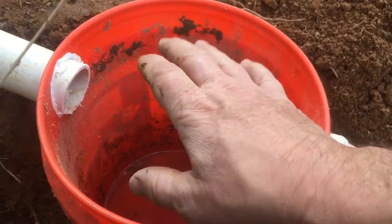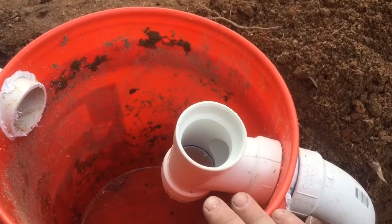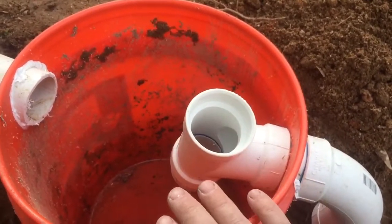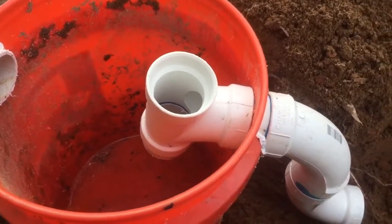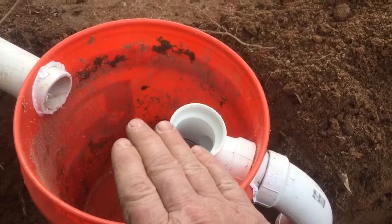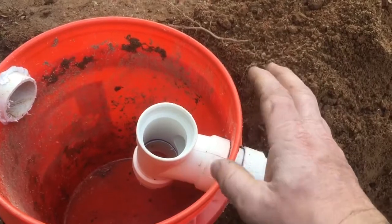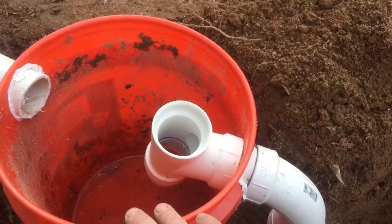In a grid-down situation you'll have to scoop it out manually. This is for a gray water system that flows on top of the ground — you don't need this if you have a proper full septic tank system. This is for a retreat property where you won't have a full septic system. You'll catch all your food particles and grease — those are things you do not want in your yard or woods because they attract rodents, gnats, flies, and other pests, especially in the summer.